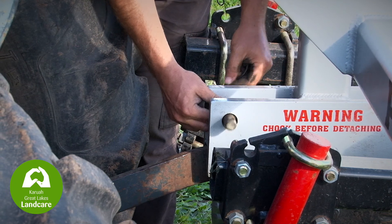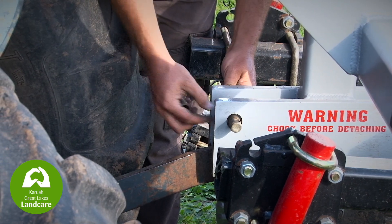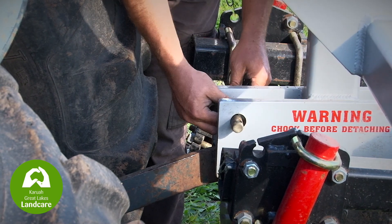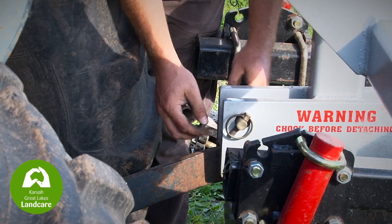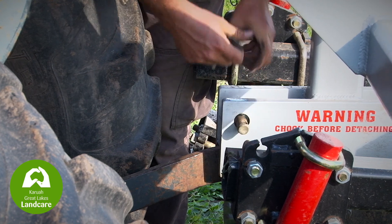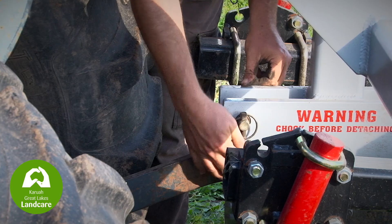As can be demonstrated here, any use of the plough without the appropriate sleeve will enable an excessive amount of room that can cause potential wear points and also dangerous shearing of the locating pin. So always make sure you're appropriately sleeved and housed securely in place.